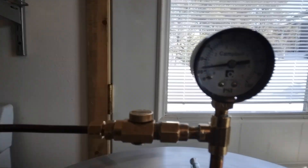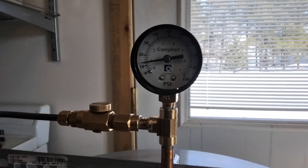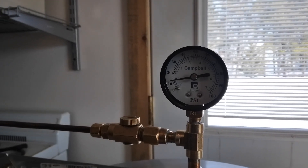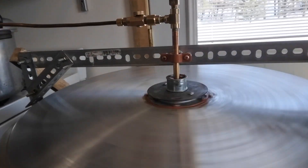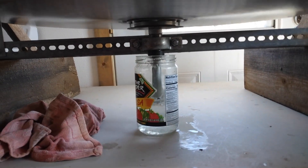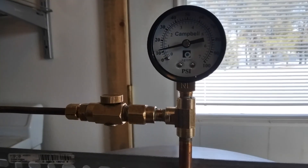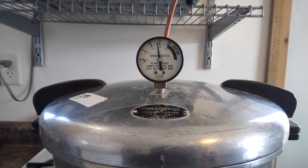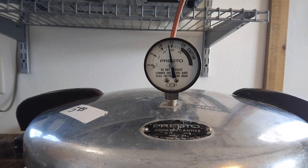It's the dynamic pressure — it's kind of dark. I pinched the ends of the nozzle down a little bit so it's a smaller opening, and I can get the dynamic pressure up higher now. About 12 PSI over here, 14 maybe, dropping a little bit.